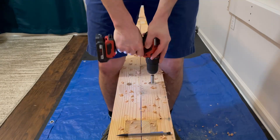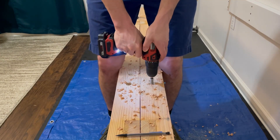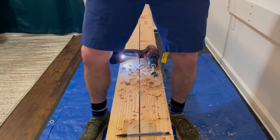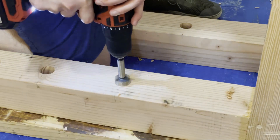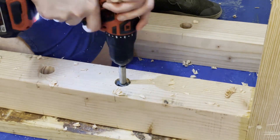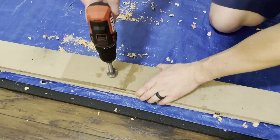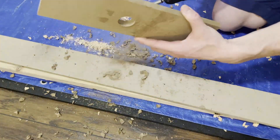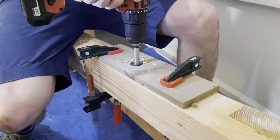After letting everything dry for a day, we marked different locations for the rack pins. Started drilling holes with a forstner bit and noticed right away that my first hole was not wide enough, so that can be easily fixed. The correct width for this size pin is an inch and an eighth forstner bit. Transfer the lines around and finish the hole from the other side. I definitely recommend using a combination square to consistently mark each midpoint of every post. To fix the hole drilled too small, take a piece of scrap and drill out the hole with the appropriate size forstner bit, then clamp down in the center of the desired location — instead of using the center tip to guide the bit, the outer edges will guide it.